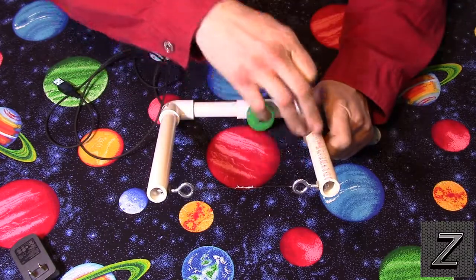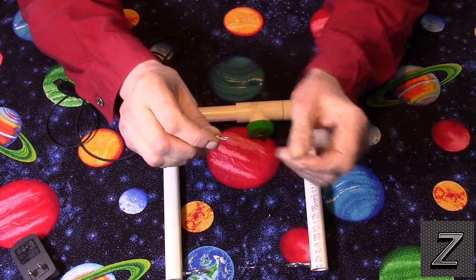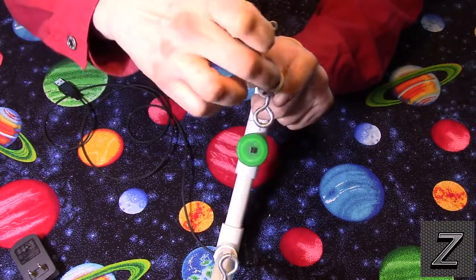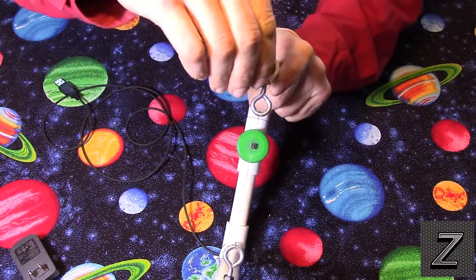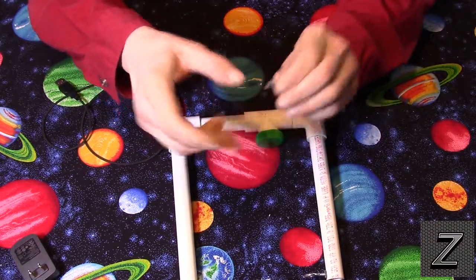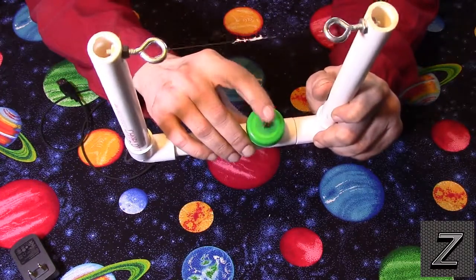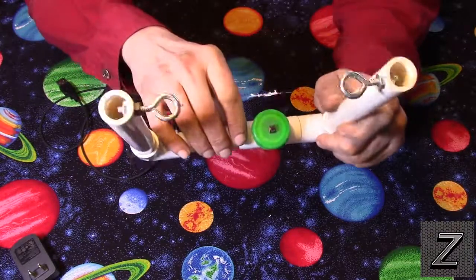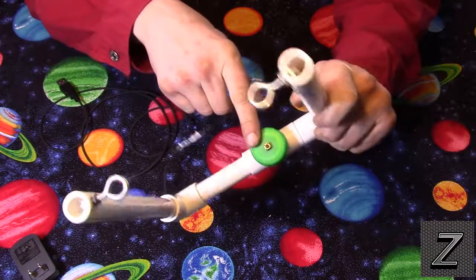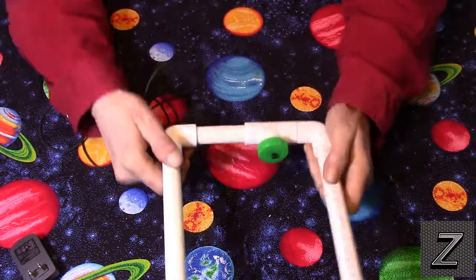Now to connect our wires inside the leads, you're going to want 2 of these. These are just those little crimp-on eyelet wire connectors, and I don't know if you can see in there or not, but where the bolt comes through and the nut's on, there's one of these between there. What I do is I crimp them on, and then I also solder them as well, so there's a good connection. So you'll need 2 of those. You'll need a little push button. I just got a little push button right here. These are extremely cheap. If you don't have them, you can salvage these out of all kinds of things. You're going to need a milk cap. This is off a half-gallon or 1-gallon milk jug. These fit this PVC pipe, which is the next thing we need.